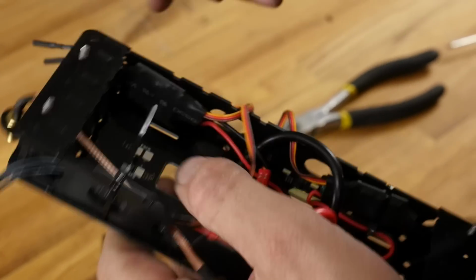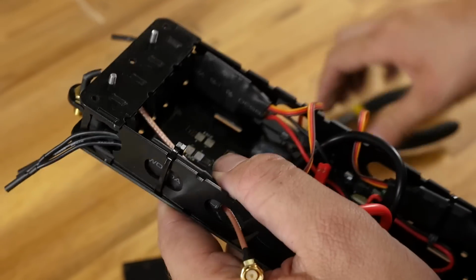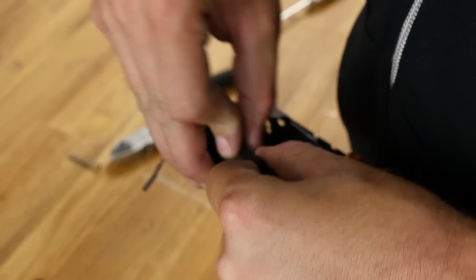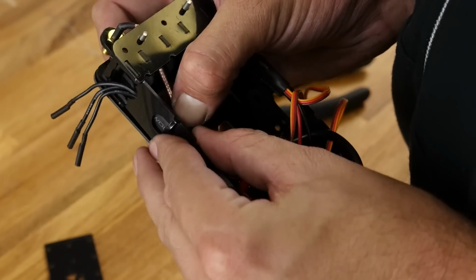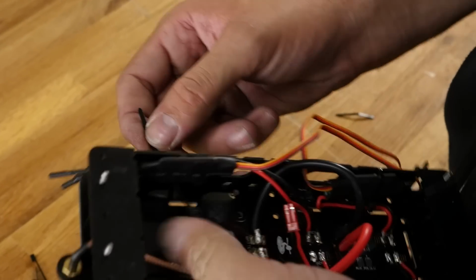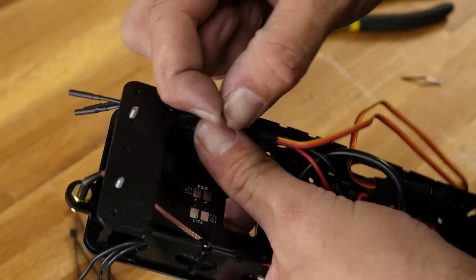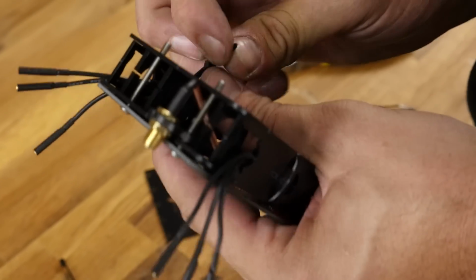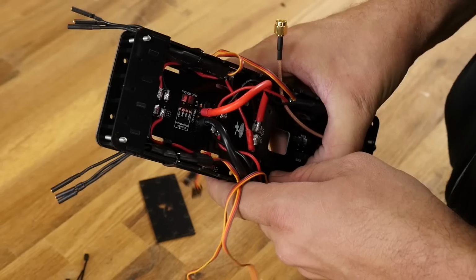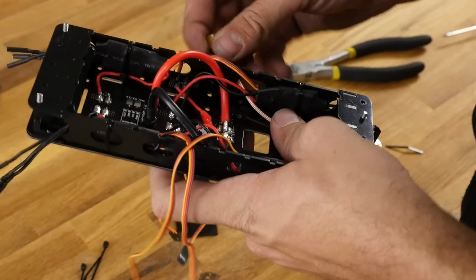Now the front and the back end of the multi-rotor are open, so airflow can go through the fronts and go over the sides. So this flat area where the heat sink is, it's hopefully going to get a lot of ventilation. We've flown quite a few of these and had very good success and no overheat so far. Tuck it down. There we are.